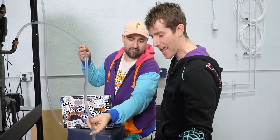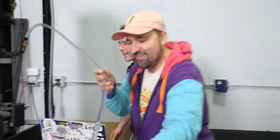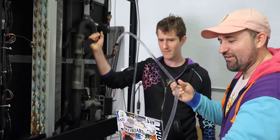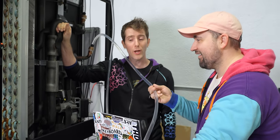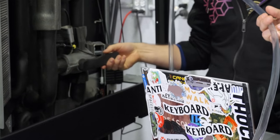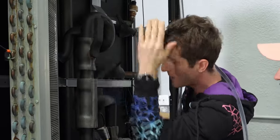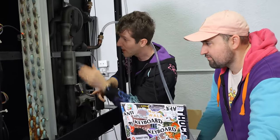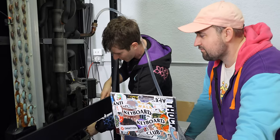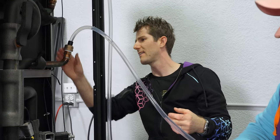Before we do that, I want to play around with these valves a little bit. Right now it's working, but if I do this, it slows to a trickle and stops. So that was open. We're learning together. This is a bypass to bypass the radiators — there's no valve for the radiators. But if for whatever reason you want the water to not run through the rads, you can bypass it here. We want this closed, because we don't want it going straight from water in to water out. By the way, it's leaking, I think. I understand why nobody else wanted them, but boy do I ever want them. This is awesome.